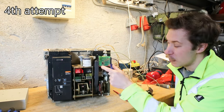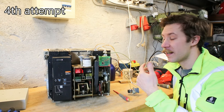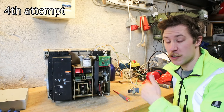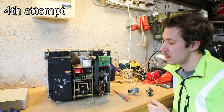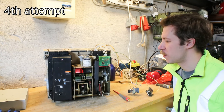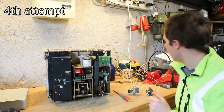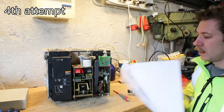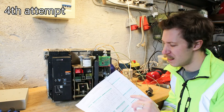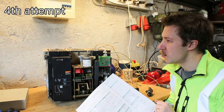Apparently we have this small circuit here with a set time — and this is the time between engaging the undervoltage coil and the release coil. It automatically tried to switch in and then switched off again. Perhaps an internal fault or missing mains voltage, I'm not sure. It's very hard to find a manual for this old unit, so I'm actually using some newer manuals for much newer products, but it seems to have the same terminal designations.